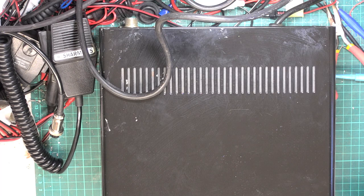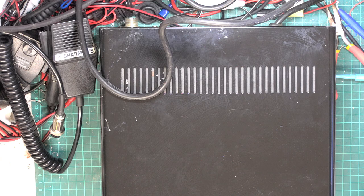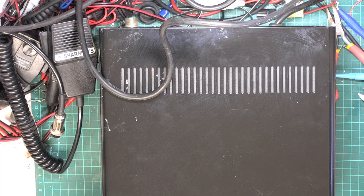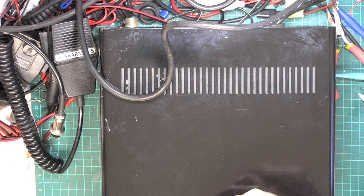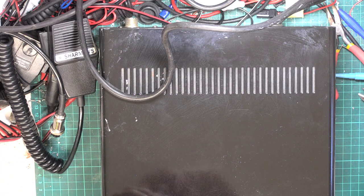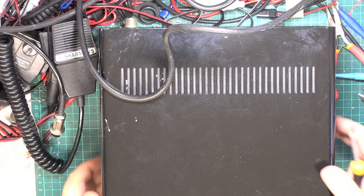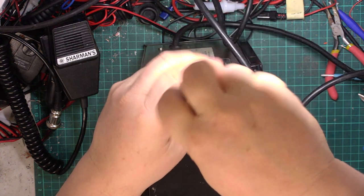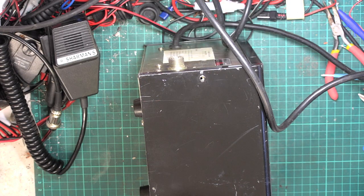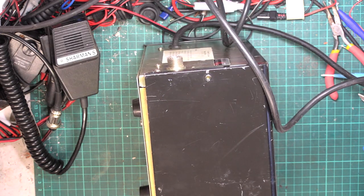I've done Murphy base stations before, the CBH1500, and I know you don't want to see these day after day, week after week, but with it being an end user's one, it may be different, because when we have them supplied by the shops or the businesses, they've already done the first line repairs, things like dodgy microphones, some of those basic things people with some knowledge can actually do themselves. I've had end users tell me that they can't SWR a particular set. Well, you don't SWR the set, you SWR the aerial. So to us as two-way radio engineers, we find some of these comments quite comical.